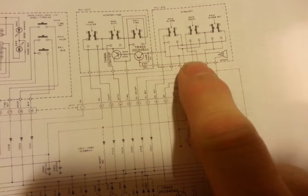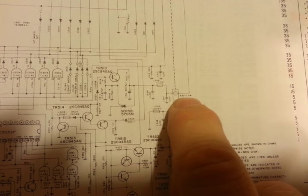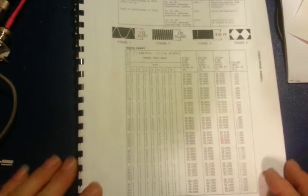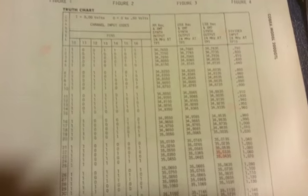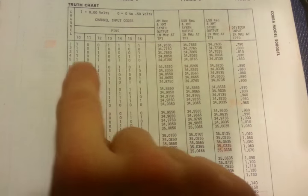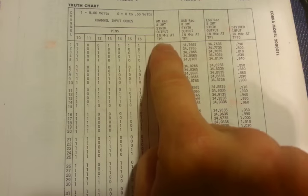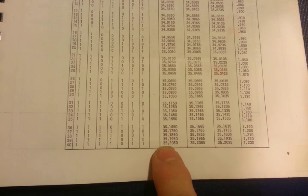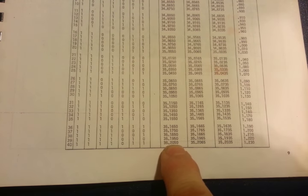And then you also have a wire that comes off of here. You can see that runs all the way down here, down to here. So radio switch, okay? Other than that, hook up a couple signal generators, and then you can come to the service manual and use this. Just follow what signal needs to be coming out of your signal generator for each channel, okay? So right now, as you saw on the signal generator over there, I'm supplying it a 35.205 megahertz signal,